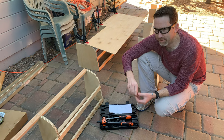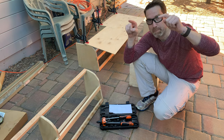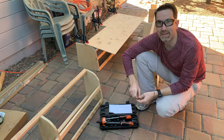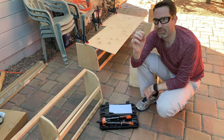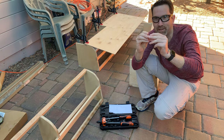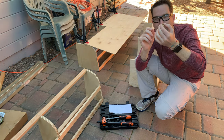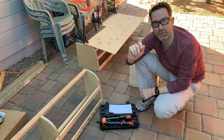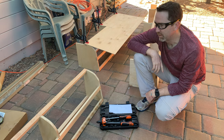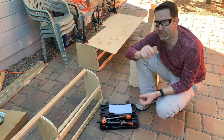Plus nuts, a lot of people haven't heard of these, but they're very similar to rivets. Rivets, you know, you put in and they deform the backside and the front side with a pin in the middle, essentially, and create a connection. Plus nuts have a very similar form factor. This is brass and it deforms the back of this portion and the front, pushes it together, but it leaves inside a threaded insert that allows you to thread a bolt in, creating a really, really stable connection in the process.